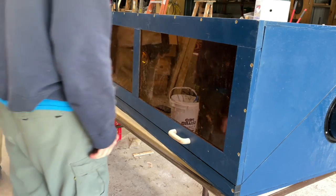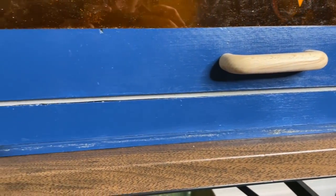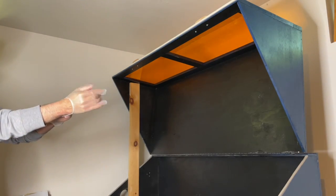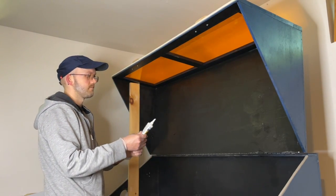The handles look great all installed. I also added foam weatherproofing on the edges where the lid shuts to keep smoke and exhaust contained. For remaining cracks and crevices around the angles — where you can see light coming through — I used a tube of silicone to fill in all the internal angles and edges where wood meets inside the enclosure, to make sure no smoke could escape.